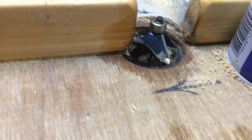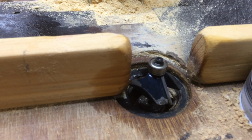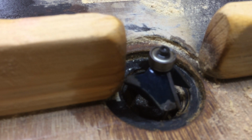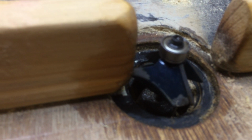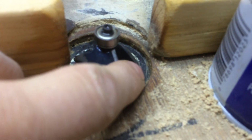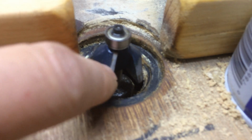Okay, I think I'm going to get some hardwood and do a little hardwood piece on it first. It's a trick that my friend does on his planer when he gets a little chip of pine in there, a little hardwood to take it out. Maybe that'll clean off these blades a little bit more because the hardwood is going to not have the pitch. And then I'm going to switch over and get working on our wood shop outside today.